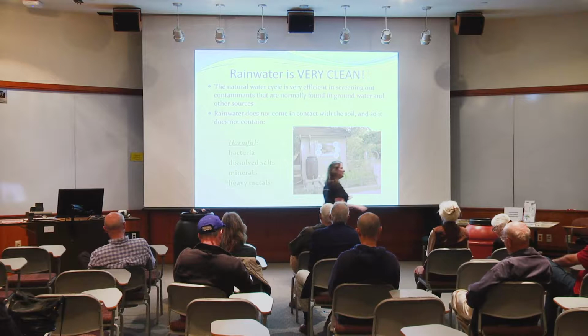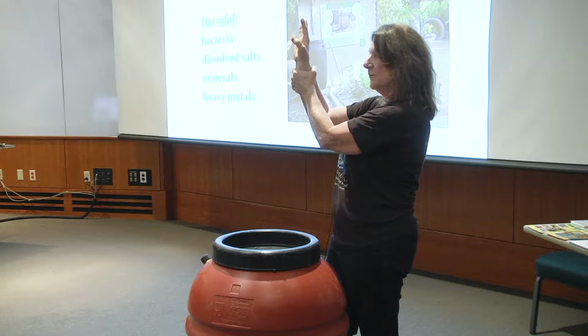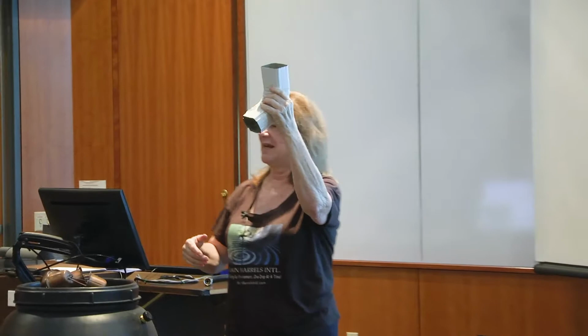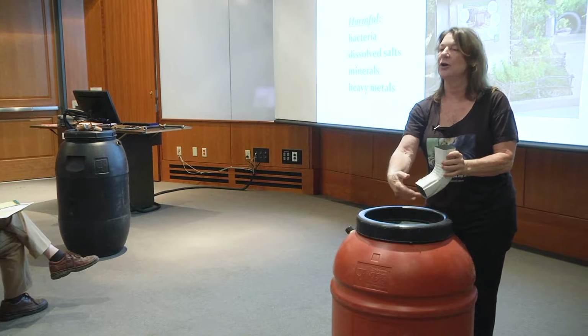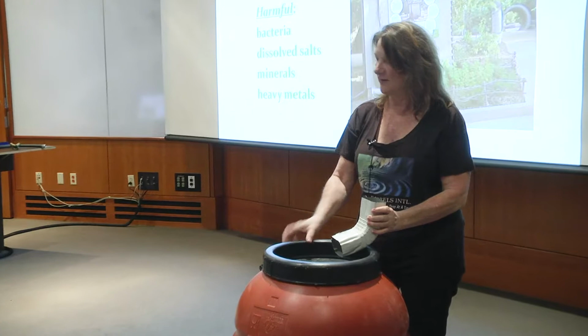Now, what I tell people is put a couple cinder blocks down, put your elbow on top, go ahead and use a hacksaw and cut your gutter in your wrist forearm area. Okay, then you're going to take your gutter piece out, and at the bottom of your gutter piece, you're going to find this piece right here. Okay, this is your angle. You just take the gutter out and unscrew this. This is the piece that's at the bottom right down here on the ground. You unscrew that, you put it right where you just cut your gutter, and you push it up and let the water just fall into the barrel. Okay. I don't put it inside the barrel. I don't touch this because if you do want to take the lid off, it gets difficult to take the lid off. But just go ahead and let the water fall in.